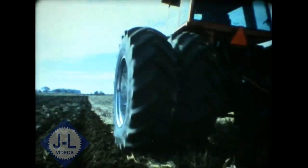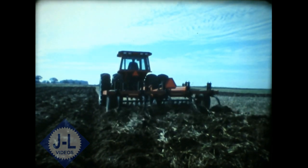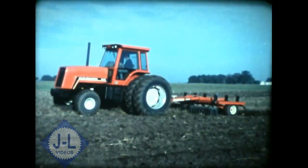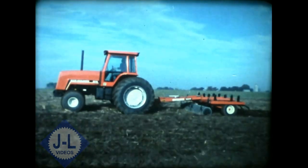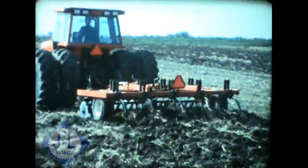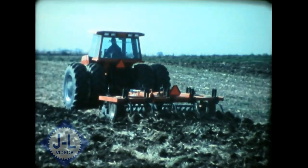It's all iron with a solid front bar and axle — no liquid ballast or concrete. With a penetrating weight of over 450 pounds per foot, the 1500 stays in the ground. Five widths from 6 to 16 feet can cover ground about twice as fast as a moldboard plow: half the time, half the fuel, more profit per acre.